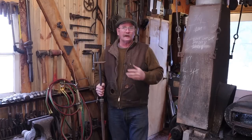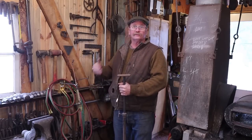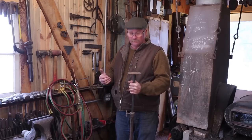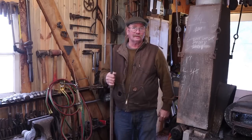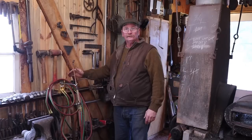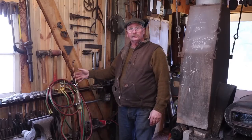I took them off of the stand — when I just had one, it was mounted to this work stand and I could take it around the shop. I had 25 feet of hose between the cylinders and the stand, and another 25 feet between the gas saver and the torch — that's 50 feet of hose I was trying to coil up. It was frequently laying on the floor, a bit of a trip hazard, and not good for the hoses. After several years of using that system, I realized I never took it anywhere — I always left it over in this corner anyways, because this vise right here is where I generally work with the torch. So I went ahead and remounted these on the tool rack. I only have about six feet of hose from the cylinder to the gas savers now.